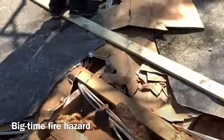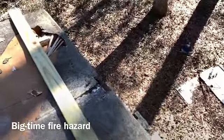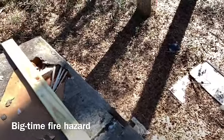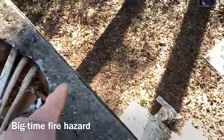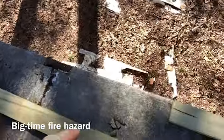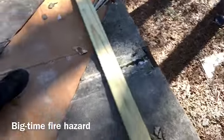You've got places like this you've got to worry about — outside edges where there's a wire running up through that power box. You don't want to run your screws into that, so you keep your screws here and there. You actually have what looks like a full inch and a half right there to screw into. It's not a three-quarter board running down through there, so he's going to screw here and there, and then they'll just screw the end and that'll be it for that one.